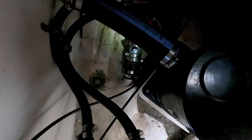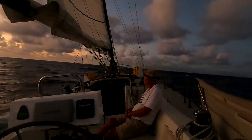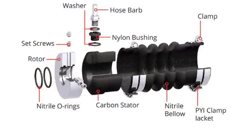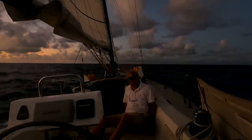So why was the shaft seal installed the way it was in the first place? Here's what I was told. There are 2 or maybe 3 options for a dripless. One is through hull irrigation. Another is an air vent hose to be led above the waterline even when the yacht's at maximum heel. The shaft seal can also just be burped by hand every time the boat's launched, if you can remember. Easy for a sailboat. Unlike a speedboat, we're only hauled out every 3 years or so.